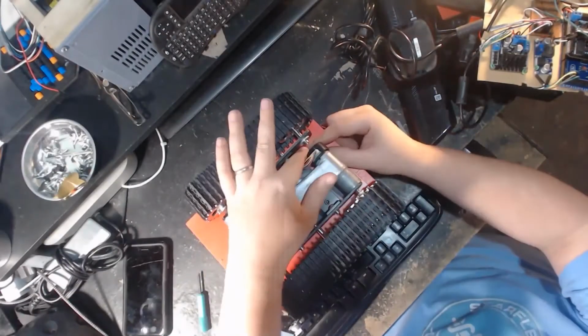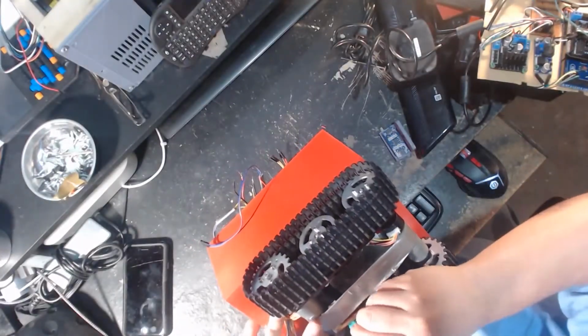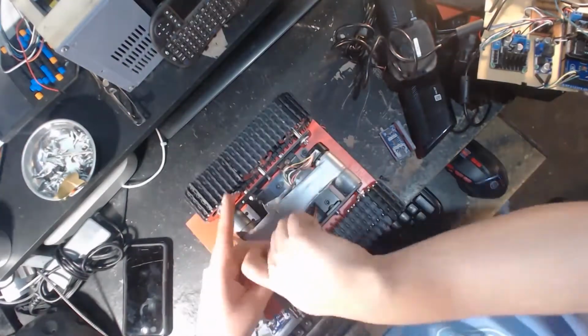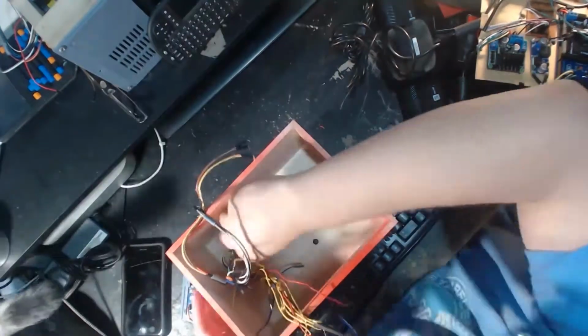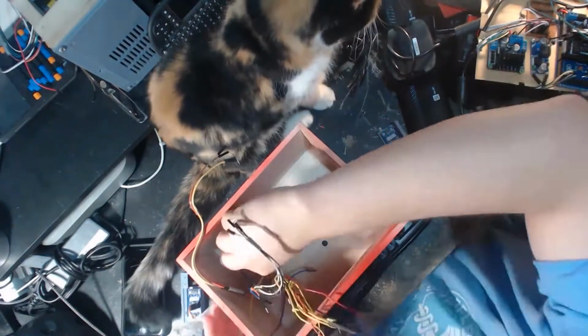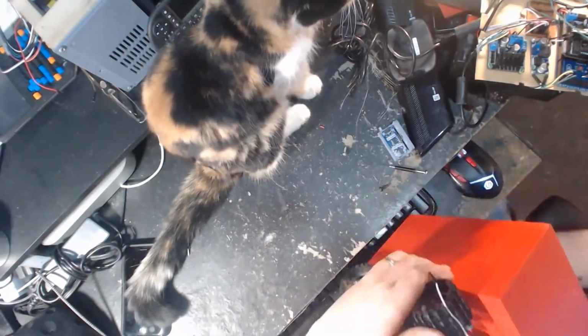space. It doesn't solve the problem of things like sliding or something like that, where a wheel will turn but it won't actually move the robot because of lack of traction. There's a lot of things when you start building robots like this that you're going to use for autonomous navigation that you just don't think about until you start seeing them roll around and realizing, hey, he thinks he's going straight, but his left wheel's sliding a little bit on this surface.